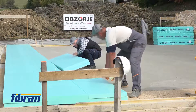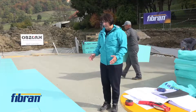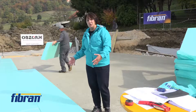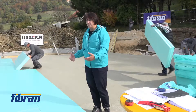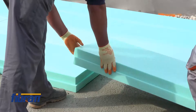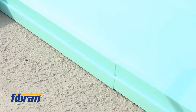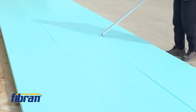One very important aspect in passive housing is to prevent cold bridges. To prevent them, we need to stick the boards very tightly together so the joints are carefully fitted, and they need to be placed in a staggered order so they are never in line.